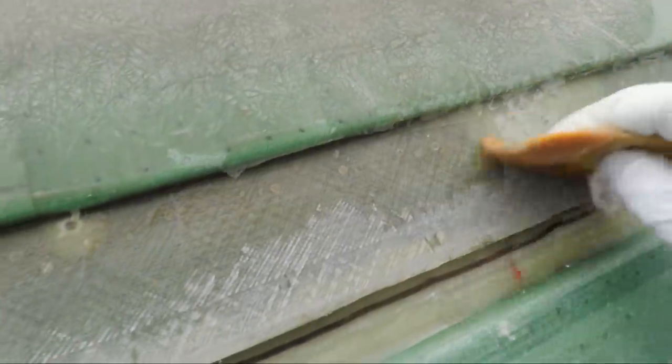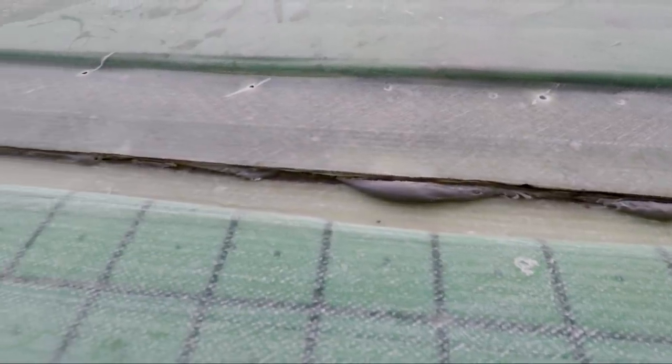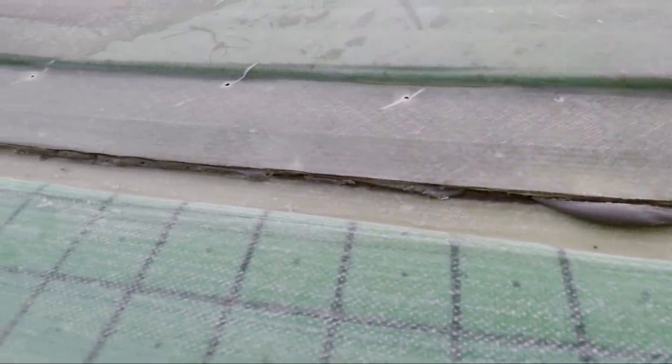The very first step Matt and I are doing, after he went through with the styrene prep for the surface, is going through with this thickened resin and filling any of the holes from the screws that we used for the cleats to pull the two sides together. We're also filling that little part where any excess methacrylate did not squeeze out, so that it is fully bonded. And then after that, we'll go through and make that ramp.